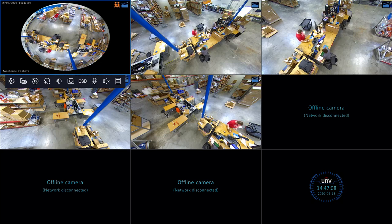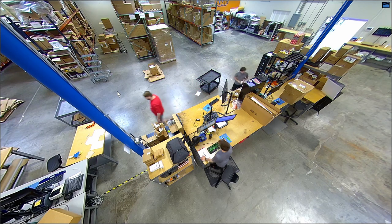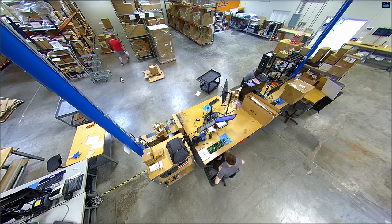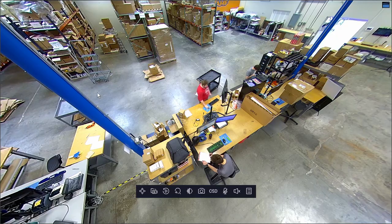A big difference to keep in mind between the 8 megapixel NVR and the 12 megapixel NVR is that only the 12 megapixel version is able to display these dewarping views directly from the NVR's live interface. The lighter 8 megapixel NVRs do not have these fisheye functions. You can still add your fisheye camera, but you won't be able to dewarp it in real time or during playback. However, even with the 8 megapixel NVRs, if you log into the web interface you will still have access to the fisheye dewarping controls — you just won't have it available on the NVR's HDMI interface.